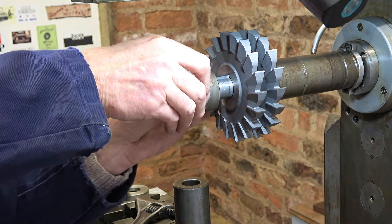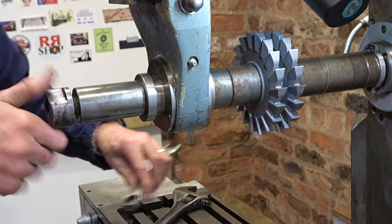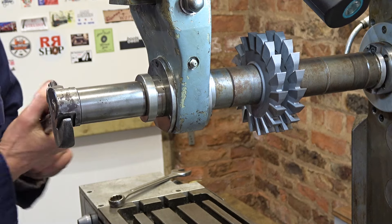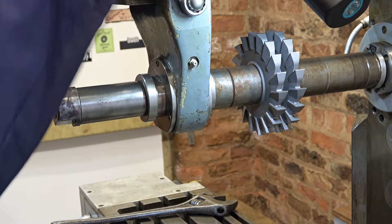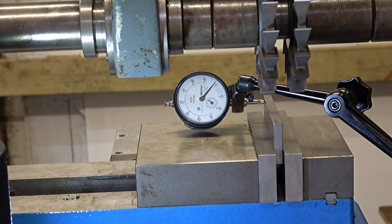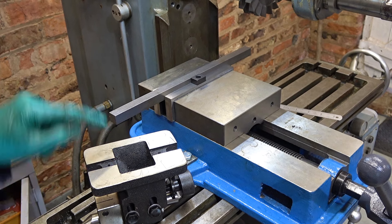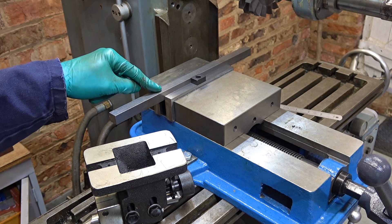I'll have to check that spacing. I've got to make a proper spanner for this rather than using an adjustable. Sorting out the tramming keys for this vice will be the next job. This channel is three millimeters deep, so when I've finished the wide part of my T on these keys, they'll need to be no more than three millimeters tall — but I need enough to hold onto in the vice.